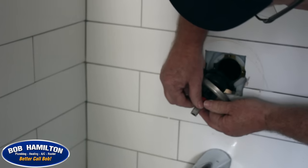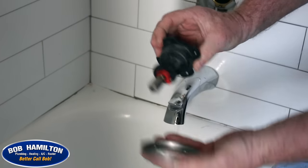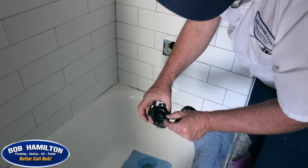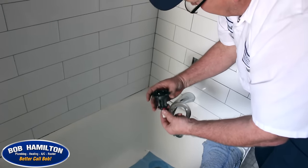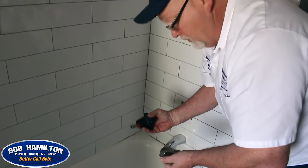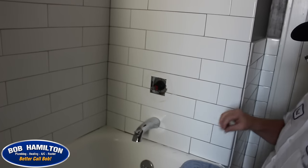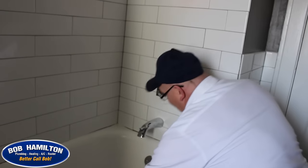Once you take those screws loose, it's just going to pop off. This is the Kohler cartridge for this particular valve. There's a set of O-rings and a set of rubber seats — those are usually what will cause the problem on this model. Kohler has a lot of different designs, so usually suggest taking the part to a local supply house to identify it. This particular retainer plate was actually marked 'top,' so we didn't really have to reference our pictures or drawing.